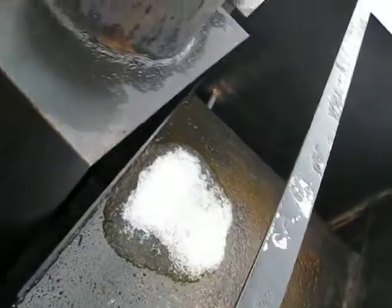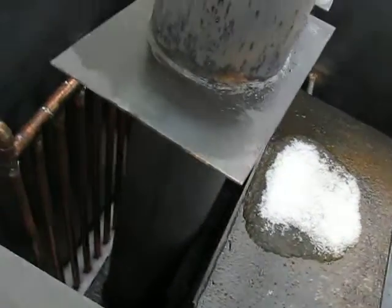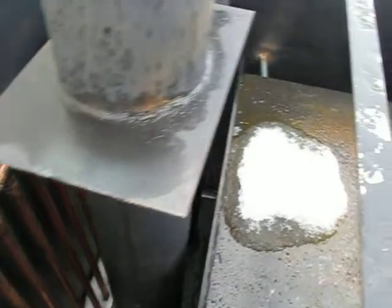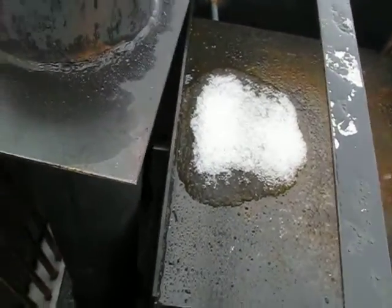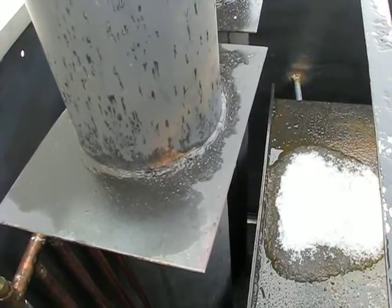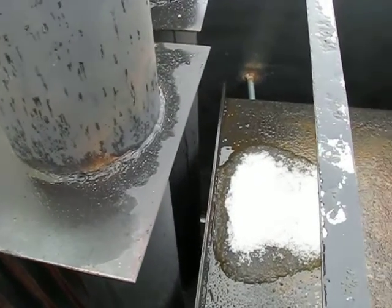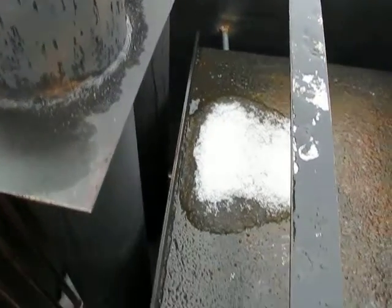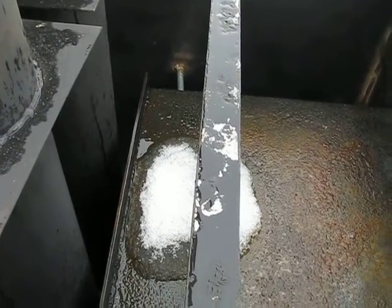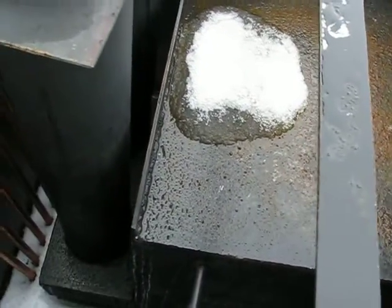That's basically it. The top here, I'm not going to actually weld anything on. As you can see, I put a lip around the entire thing, and I welded those onto the pipe. So basically, I have a sheet of metal that I'll put down on here, and I'm going to screw it down. Put some RTV glue or something like that, so it'll actually seal it off, and screw it down. And that way, in case I need to actually do some work on here, I can pull that off and get inside without cutting open my boiler.